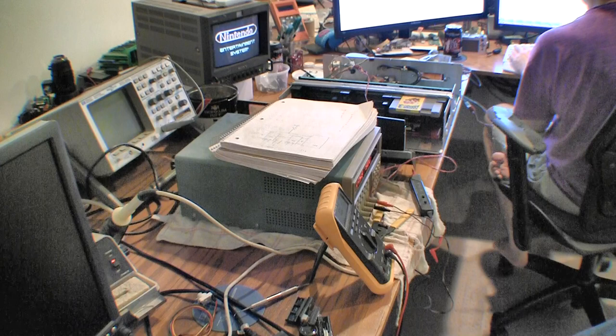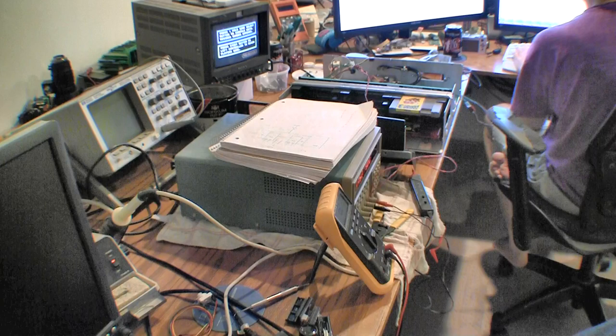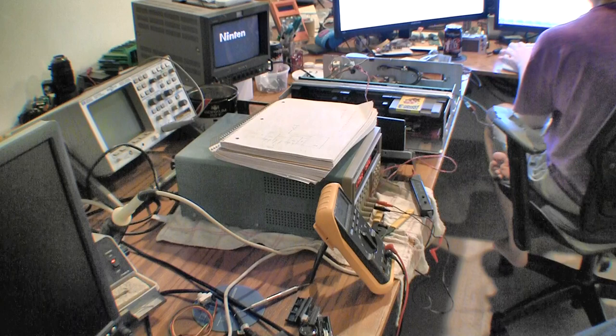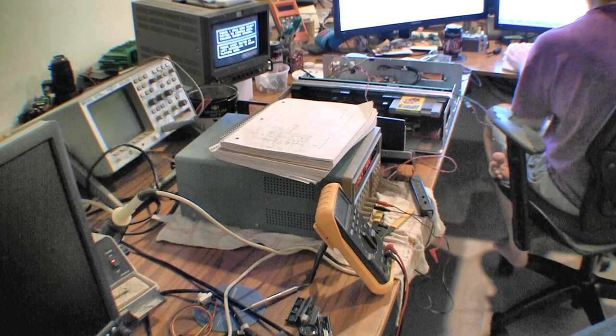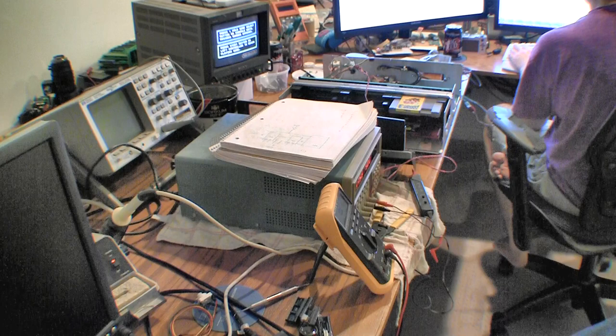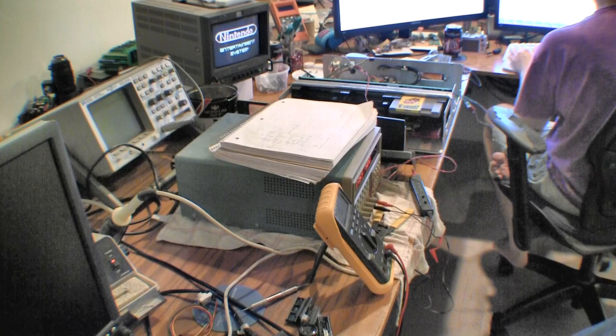In there, see how that works. There's 5. Damn it, don't do that. So now basically what it's going to do is check for that button. And if you've pressed it, it will get out of the attract mode, and you can't go back in until you cycle the power again. That's good. I'm sure that's fine. That way when they're playing, it doesn't just go into attract mode for no reason.